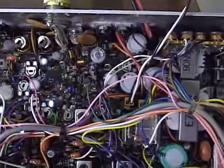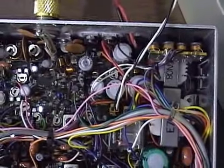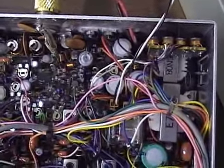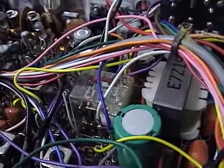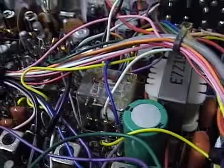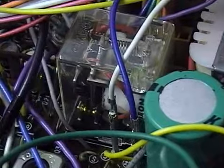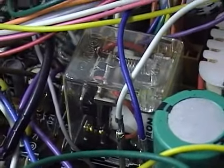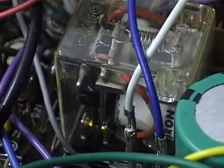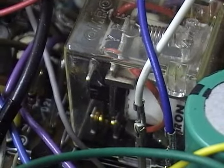Once you tune the radio up, you'll probably see about 15 watts on sideband and AM swing as well. Dead key power you want to keep under 4 watts, especially on the older radio. Often with these older radios, when people key them they'll hear a clicking noise inside — that's actually a mechanical function. And just to show you, you can actually see the switch moving as I key the radio.